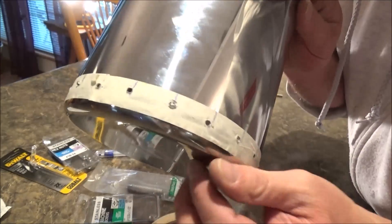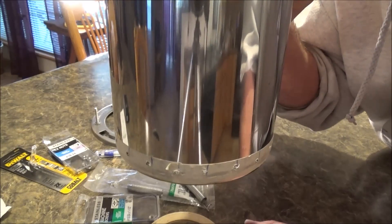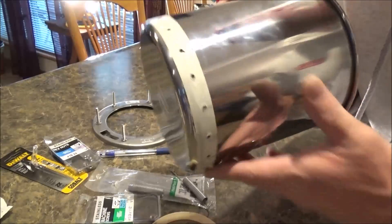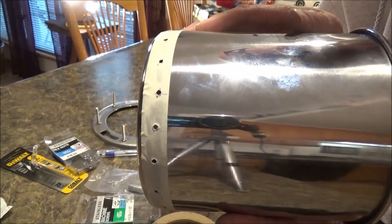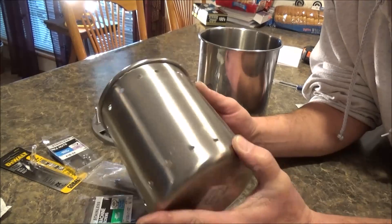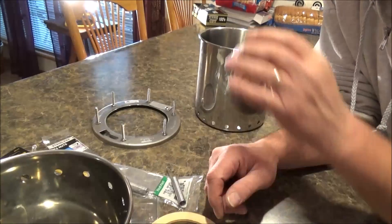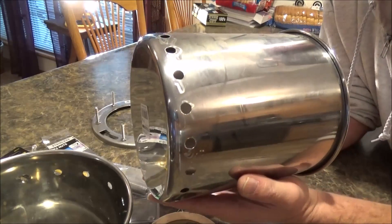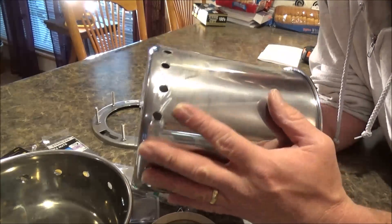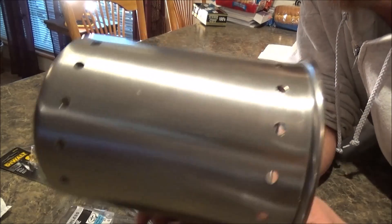The holes are drilled one inch apart. I put them just a hair lower, about in the center of the tape. I'll take the tape off and drill quarter-inch holes top and bottom in the inside chamber, and just the bottom of the outside chamber. It went through pretty well — only took about five minutes with a good eighth-inch bit. All done; took about 15 minutes total. I put all quarter-inch holes in the inside chamber top and bottom. For the outside chamber, quarter-inch looked too small, so I used three-eighths-inch holes — 20 holes in the outside chamber and 15 holes top and bottom in the inside chamber.